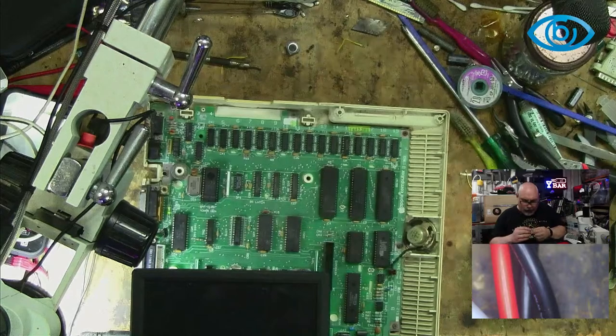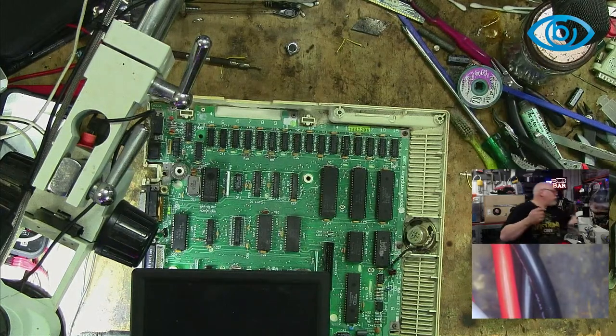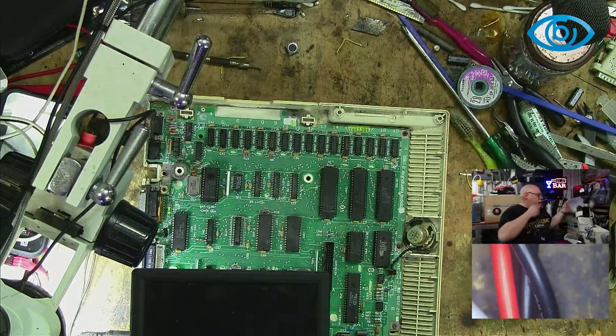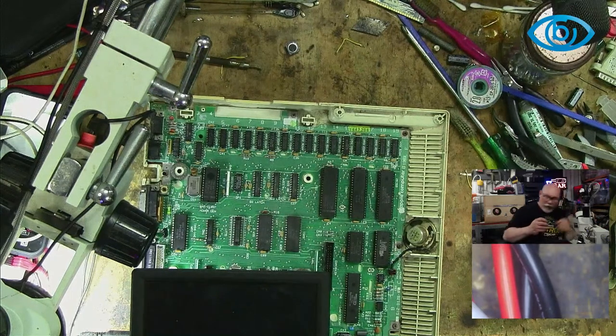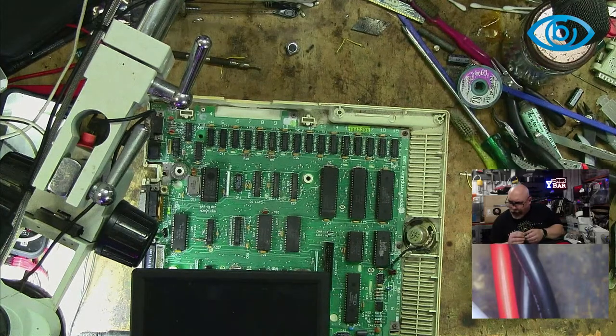So let's start again from one. Oh, this chip looks a little bit manky. I'll try another one. Yeah. This one looks nice. These are NEC chips. Incidentally, these are the same chips that are in a Macintosh 128K. They fail in those as well. So it's nice that I can buy these chips that serve two different masters.